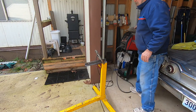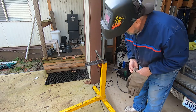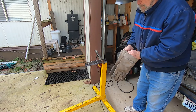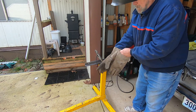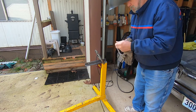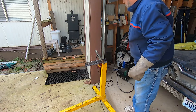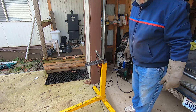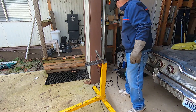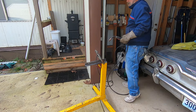We're going to get this welded up. One thing you might want to notice is this little magnet down here. A very important thing when you're doing fabrication work — have one of those available, or about a dozen of them actually, because they help hold things in place rather than trying to hold it yourself and then dropping it, misaligning it. Get yourself some of those; they're real cheap at Harbor Freight. They save a hell of a lot of work.